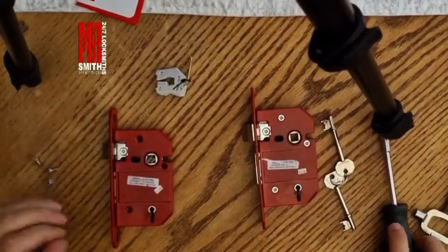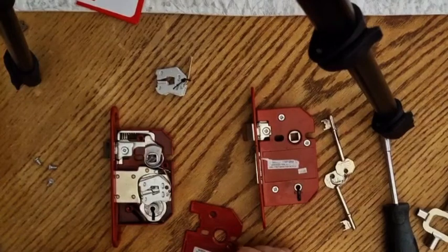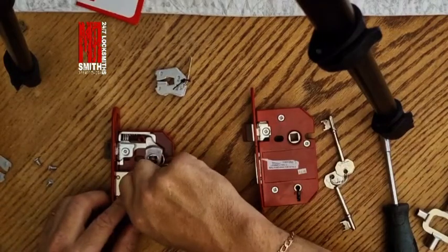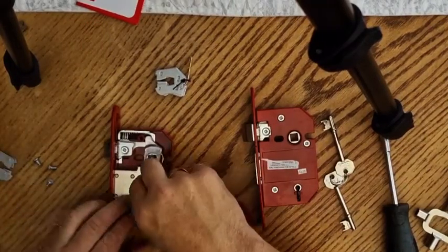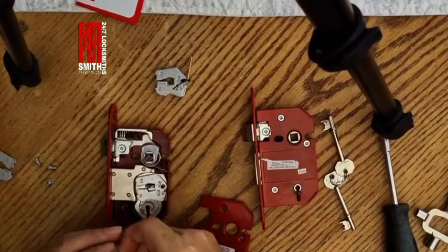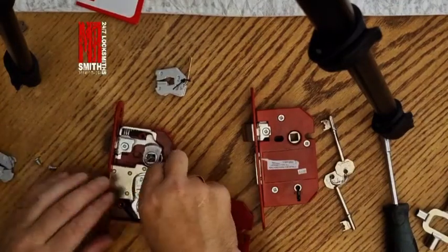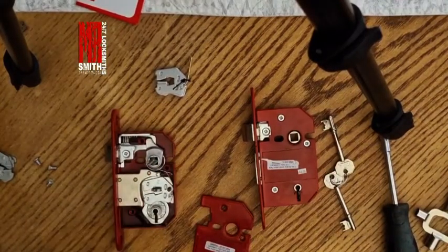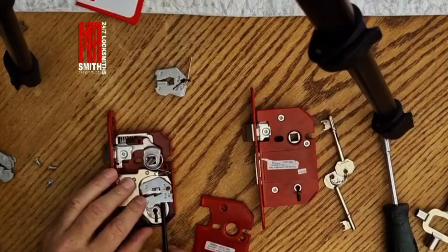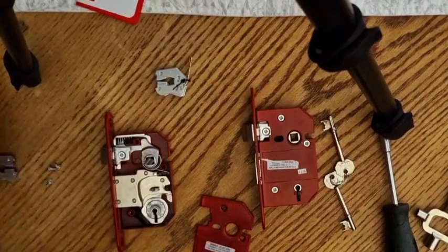It's held with 3 screws, and this is where you need the tool, because if you take that out, a massive spring down here just pings out. So we've got that one. I'm taking them out in a particular order so that I know when I put them together that's the order for that key. I'm going to need my small screwdriver, just because with no fingernails you'll need it all the time. Take that one out. So those levers will go with those keys.